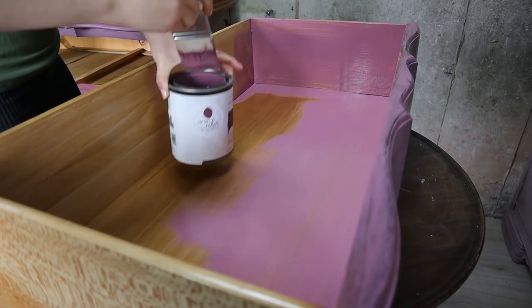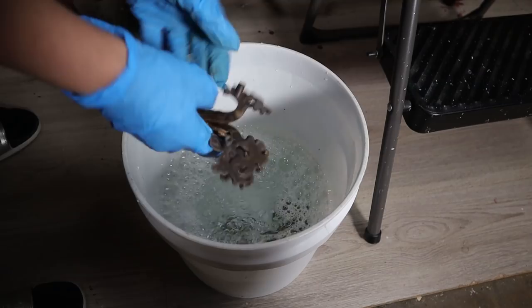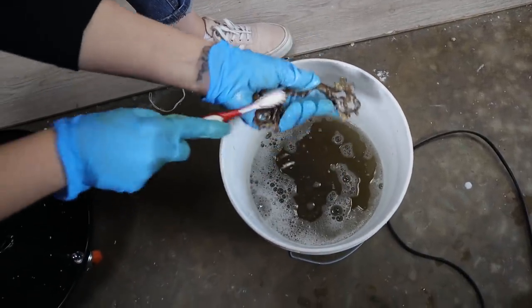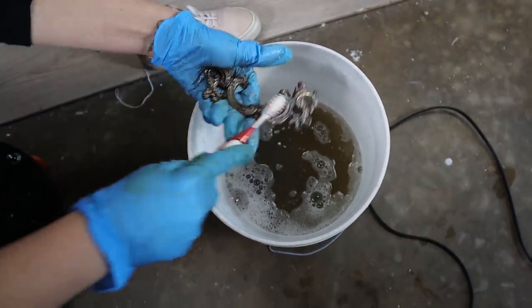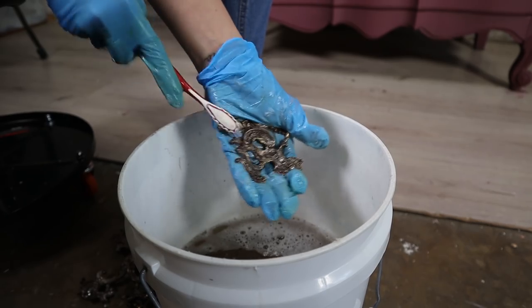There was some kind of odor and we needed to cover that, and Amy Howard paint is great for that because it has a primer and a sealer in it, so it's going to seal that smell. For the hardware, I first dumped them in a bucket with dish soap overnight. The next day I went back in with an old toothbrush and got lots of dirt off them — this hardware was full of dirt. I ended up using three coats of paint inside and outside for this dresser, and I used a 32-ounce can, which I think is pretty good. If I didn't paint the inside of the dresser I would have used probably half of the 32 ounces.